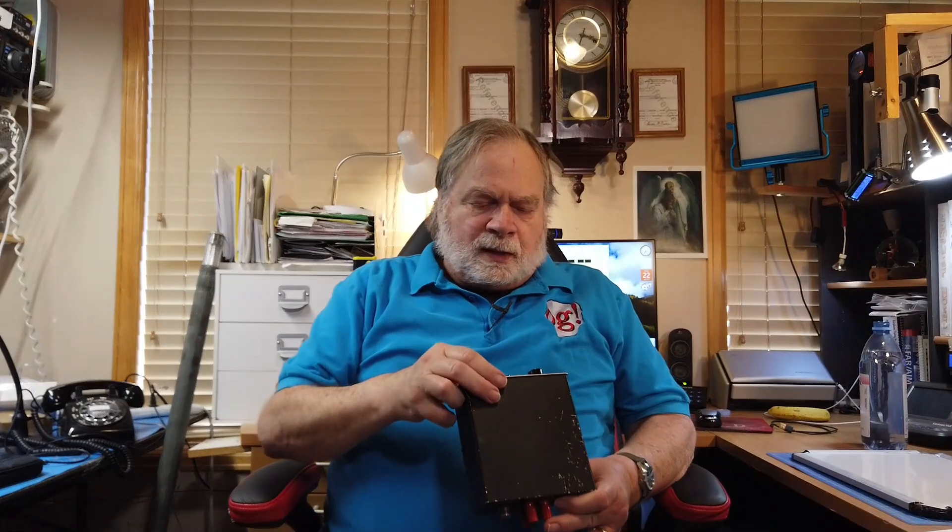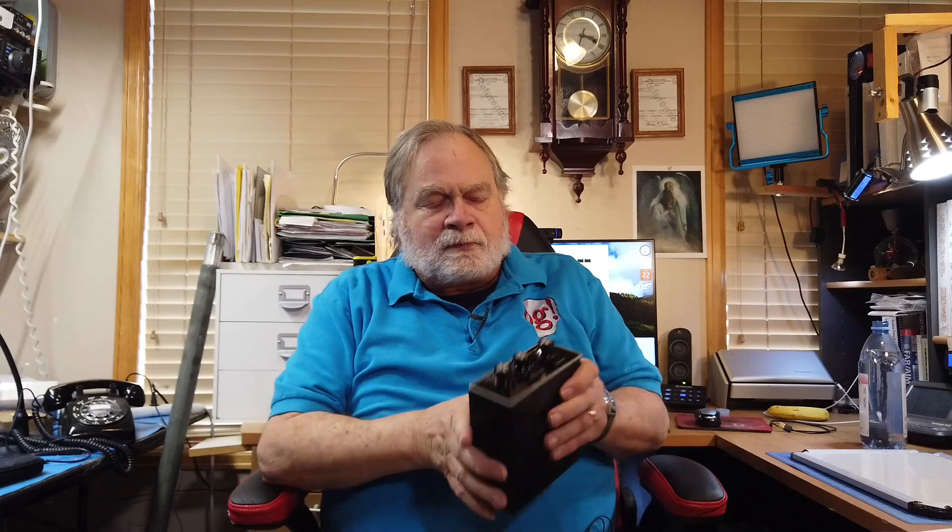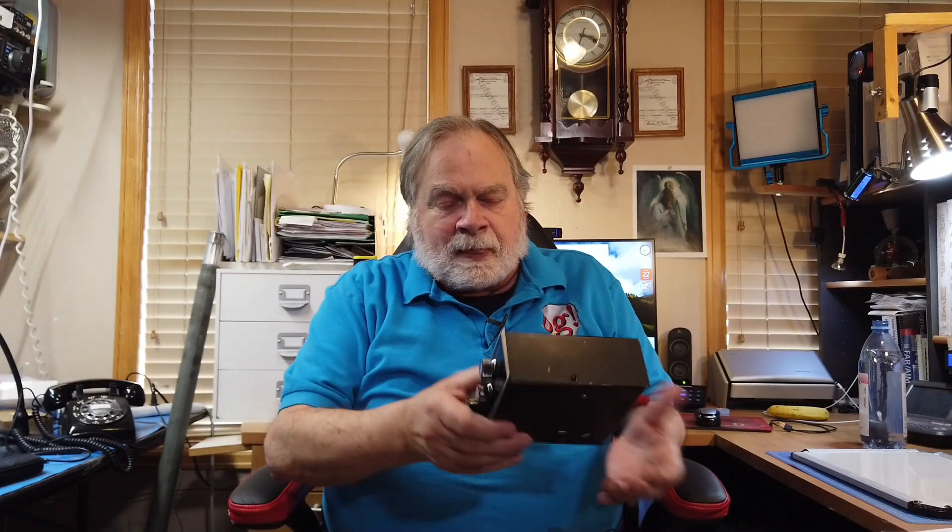Another thing that you can do — and I just did a video for this that shows what's inside of it — this has in the back a little place where you can connect a wire antenna. You unscrew it, put the antenna around it, screw it back, and then you can actually tune that antenna to whatever shortwave band you're listening to. The way you do that is simply: you start with the middle one, tune for max noise, and then adjust one and the other, going back and forth a few times, until you've got something you like.